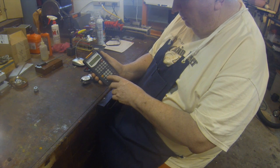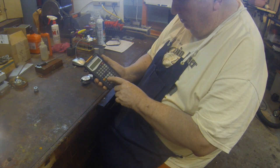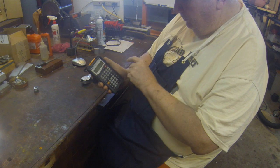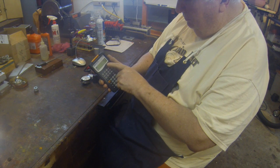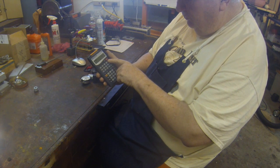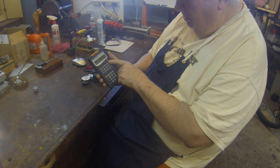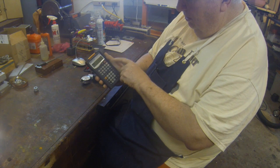Let's say I wanted to do a 1/4 inch tapped hole, I'd say 1/4, then go to thread size and enter 20, thread size, hit it again. That gives me the tap drill size is number 7. Hit it again, that's the closest drill size in metric. A close drill, a free drill, and the pitches, minors and majors on that.